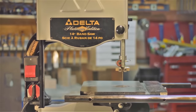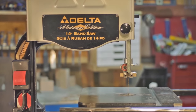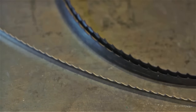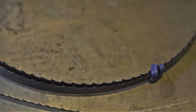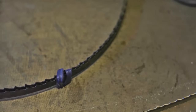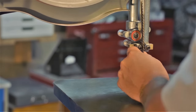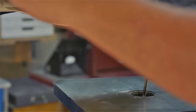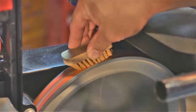If you're type A, you'll find that owning a bandsaw is like polishing a turd. You're just never quite happy with the results it gives. Being financially challenged, I no longer buy the expensive silicone blades, just these $5 end-of-run carbon blades from a local saw shop. These fancy silicone blades I found cost about 5 times more, and they really don't last a whole lot longer. Sometimes they get dull quicker, so bye-bye.